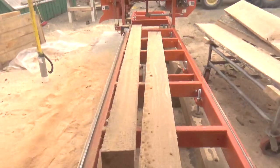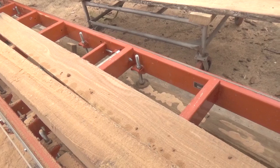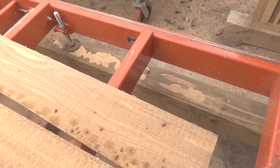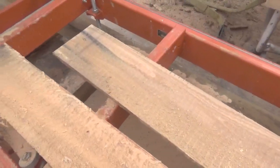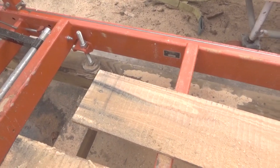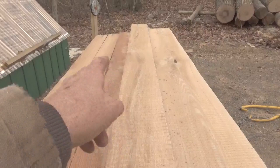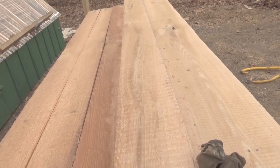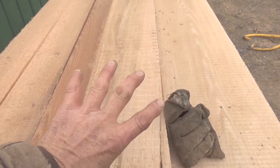So what I did here was the cant was 8x7, and I don't like odd-sized boards. When you go to sell them, people are so used to even-sized boards that they think there's something wrong with them. Anyway, you can see that board came out pretty good. There's a little black mark at the bottom — it seems water or some sort of stain was running down the branch that was actually above that. I cut that off and that gave me a 6-inch cant. Now I'm cutting this 6-inch cant and I want to show you the 3 boards I got off of that and why turning the cant is a help. You can see the stain running down to the middle — it's actually what I think is a shake in the wood. The next board I took when I turned the cant — I took this board and turned the cant this direction.